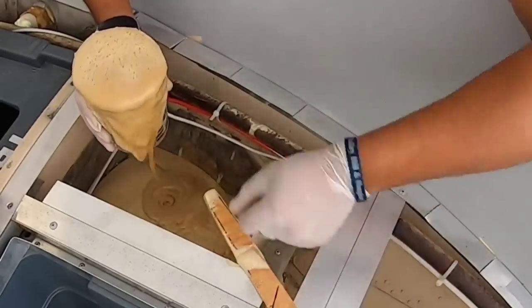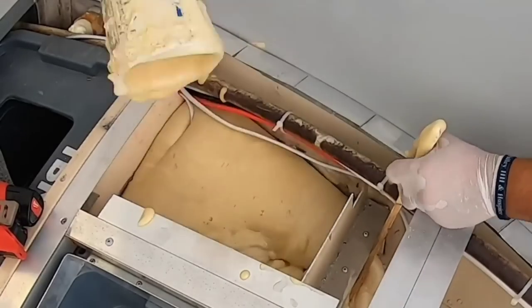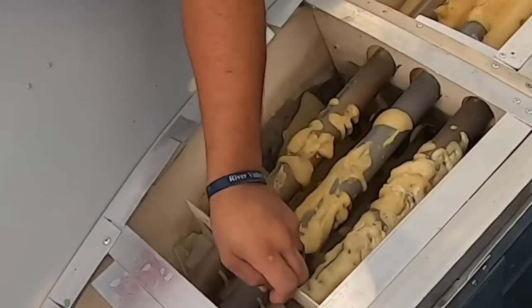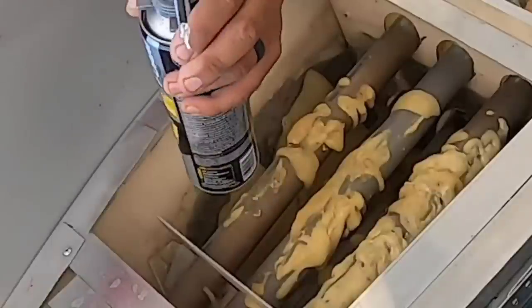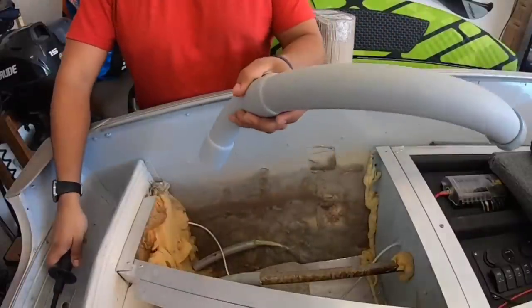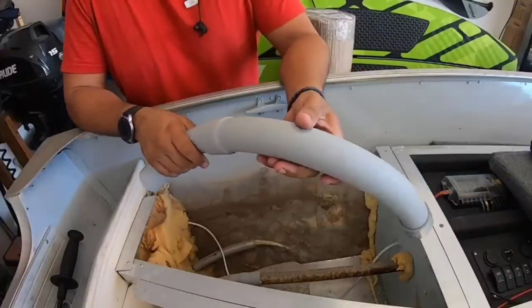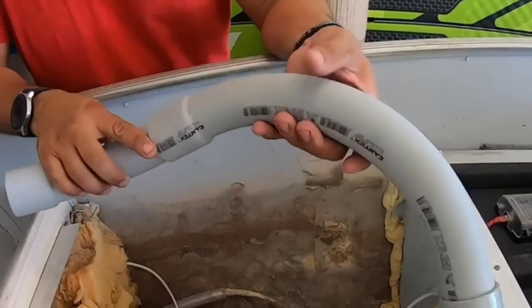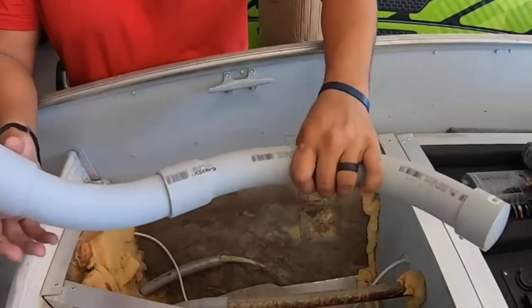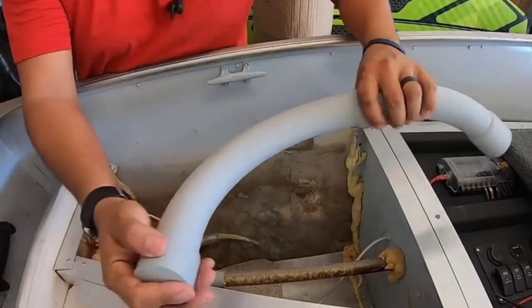Now we just have to finish the foam process, filling all the open voids in the boat that aren't storage. It's really important to do this because it helps create reserved buoyancy in the boat — it takes up voided space that water cannot get into and it's significantly lighter than water. The added benefit with pour foam is that it makes the frame even more rigid and much smoother. It takes on waves better. The whole boat rides better with a ton of pour foam in it. The disadvantage is that once it's in there it's not going to come out, so we're making a bunch of different conduits throughout the back parts because they were full of foam, so we're making bigger foam offsets with conduits running through.